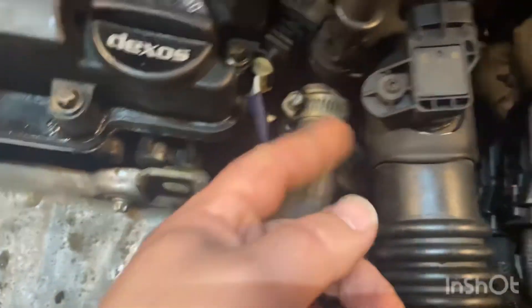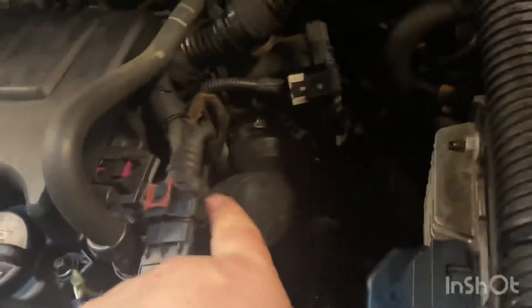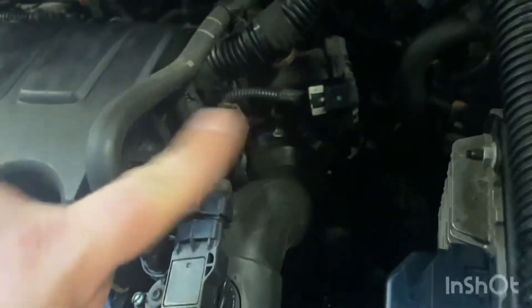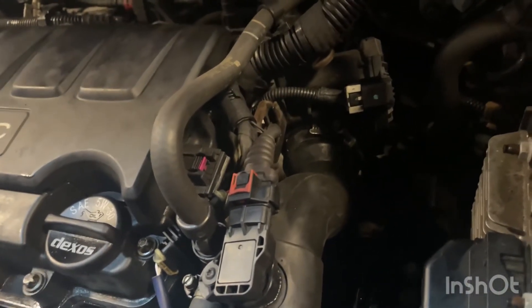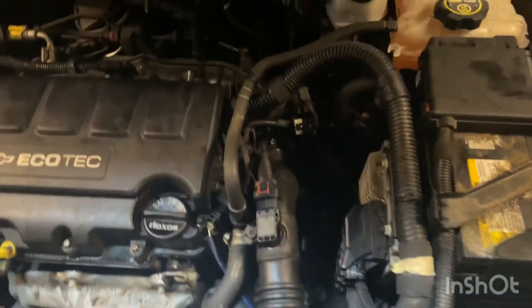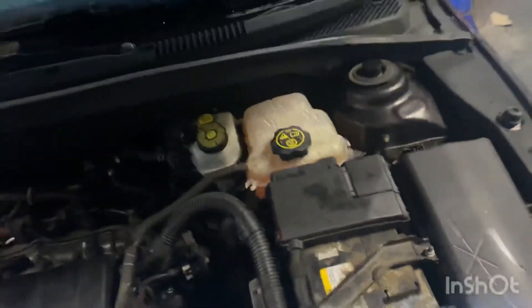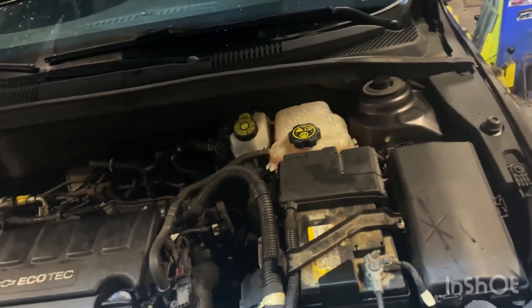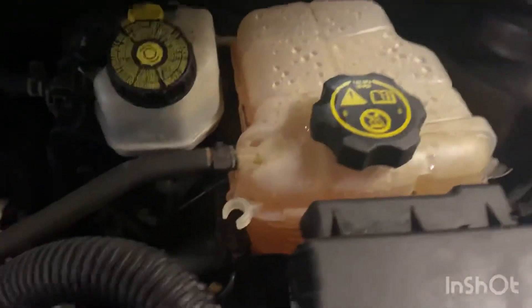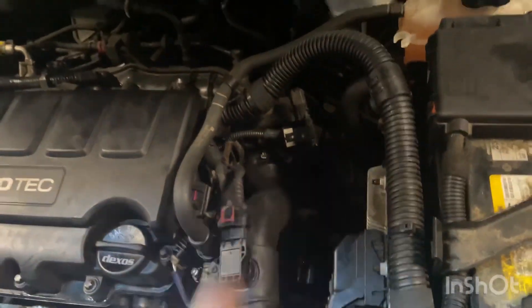All right, we got everything connected. There are a couple of hose clamps here and here, a hose clamp in the back, and three bolts going in. Make sure you got all your sensors hooked up and the red clip snapped back in. Where the outlet mates to the head and block, make sure that surface is nice and clean before you put the new one on. We filled it up with coolant — a little over the max because it's gonna suck some down. This thing will bleed by itself. Take it for a drive, get it up to temperature, let it completely cool off — never open the cap while it's hot. Top off your coolant and you should be good to go. Keep an eye on the coolant for your next drive too, check for leaks on all your hoses and your new seal. Thanks for watching.